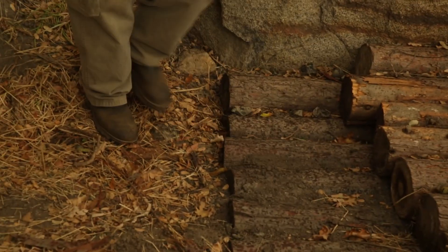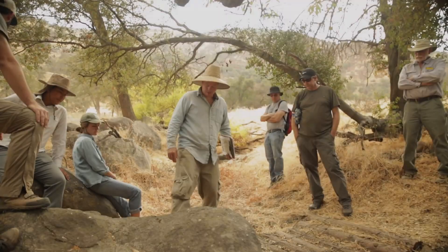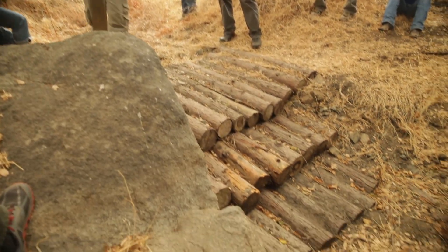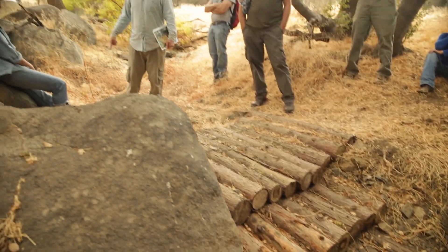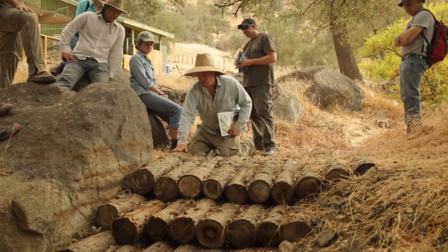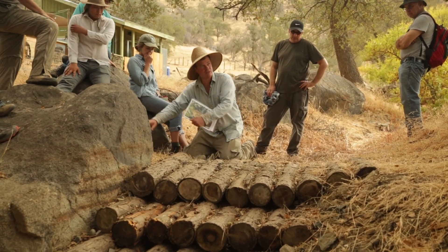There's deposition here, and that's a nice thing to see. I'm always looking for deposition in these structures — where is it depositing, is it doing what I expected, is there vegetation? Here is the weakest point and water is going right down there. So this structure works all right, but at this point it's getting flanked. That will propagate and undermine the whole thing, so we've got to fix that. We need to fix the elevation of this relative to this so that water gets pushed into the drop structure as opposed to outside and around it.